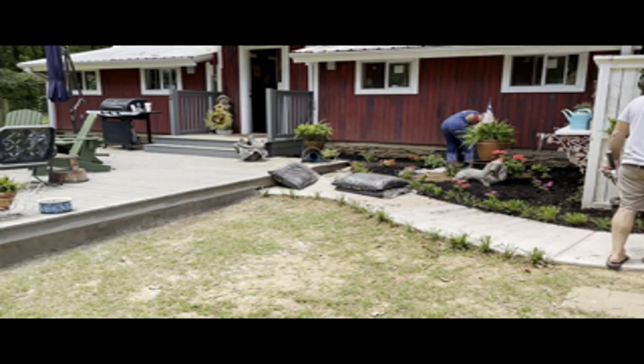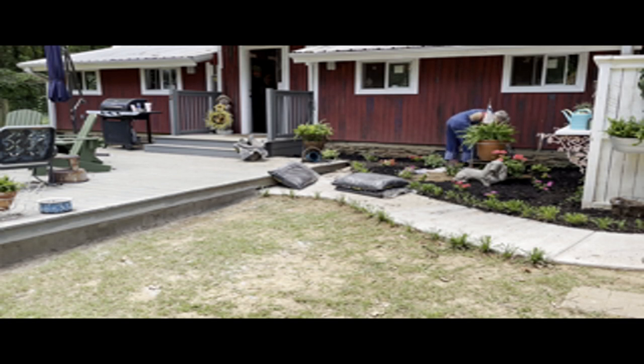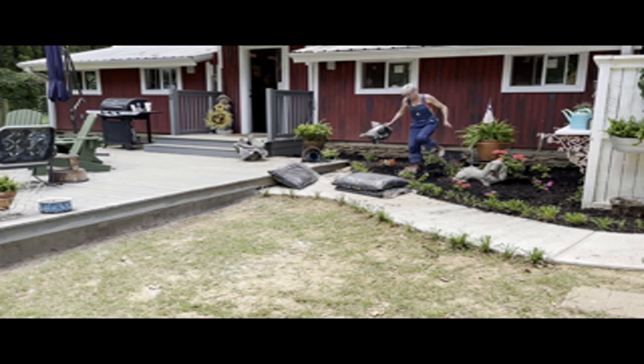Once I got the completed coverage on this side of the deck, I go back over it with a 4-inch trowel, doing the same motion, going from bottom to top, and pull the mud up with your trowel gently from bottom to top, just to smooth out as much of it as you can and get a nice flat, easy working surface for your second coat. My next video will show a lot of detail on that. I kind of got caught in the moment and I was just going to town on this thing and forgot all about the camera.